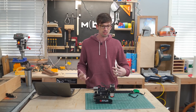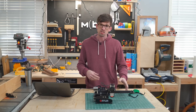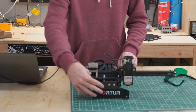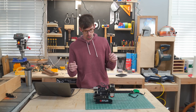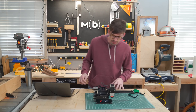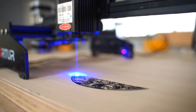Talking about the build for a minute — it's pretty much plastic and aluminum. The rails are extruded aluminum rods, pretty similar to most builds like this, and the supports appear to be acrylic, so it's not super rigid. But again, you really don't need a ton of rigidity for laser engraving. It uses a belt system rather than threaded rods, so eventually that belt will probably stretch out and you'll need to tighten it.